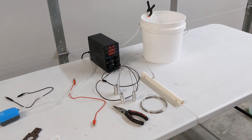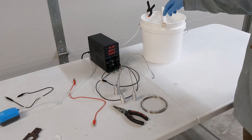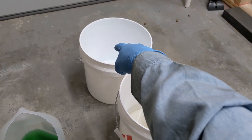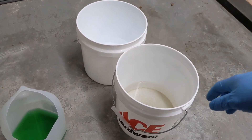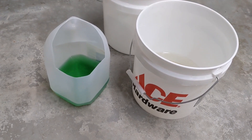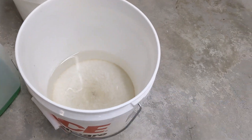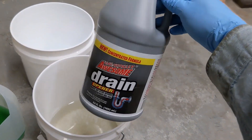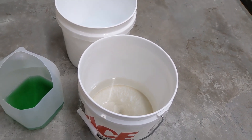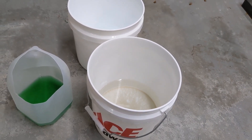That's kind of it for the anodizing process. The last thing is this piece of PVC pipe that I made — that'll go over the top of the bucket and give me a nice surface to hang my parts from. I've also got some buckets over here. This one in the back is distilled water with some baking soda — that's for rinsing the acid off the parts. And then I've got some Simple Green right here, about a 4-to-1 mix ratio — that's to degrease my parts before anodizing. Lastly, I've got this bucket of lye. This is just Drano, which I got at the dollar store. That basically just etches your parts and removes any impurities, or in the case of my electrode, I was able to remove the previous anodization.